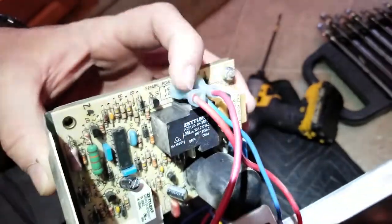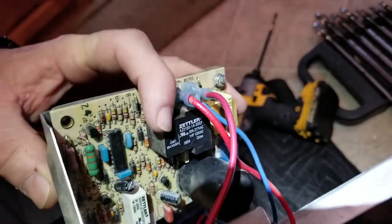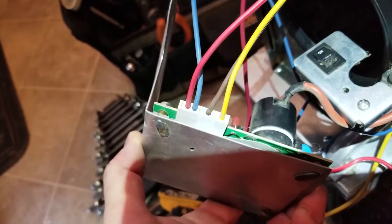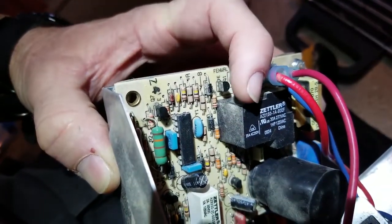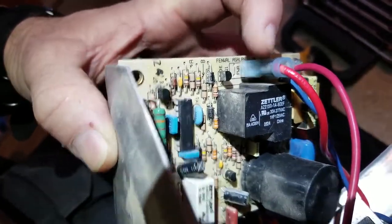This has got 12 volts on it — this one goes to the motor right here. It's got to be this relay on the control board because I've got a constant 12 volts here. Over on this side on the blue wire, I've got a constant 12 volts, which is coming back from the sail switch. I've got my good ground. So the only other thing left is this relay on this board is intermittent. We'll know we've succeeded if we put a new board on and it works fine every time.